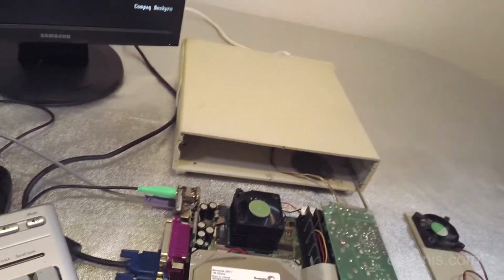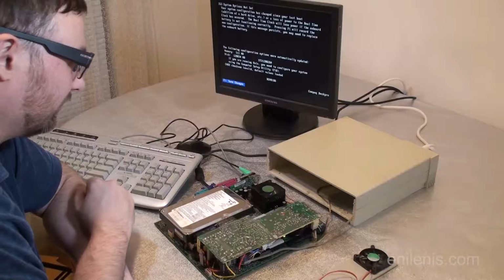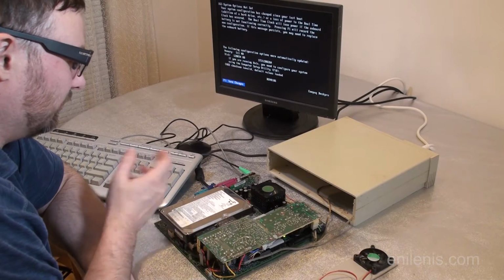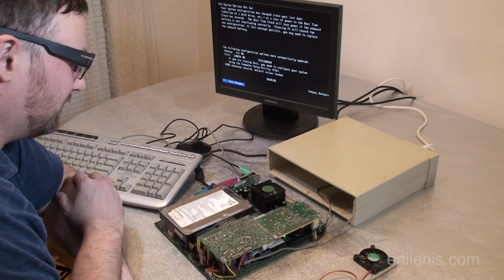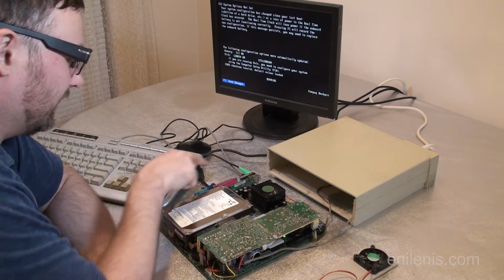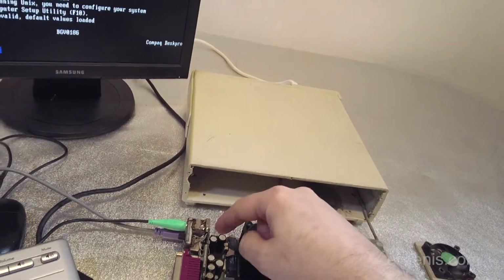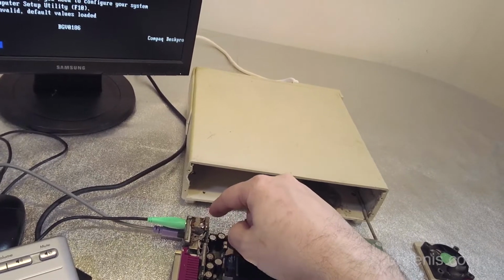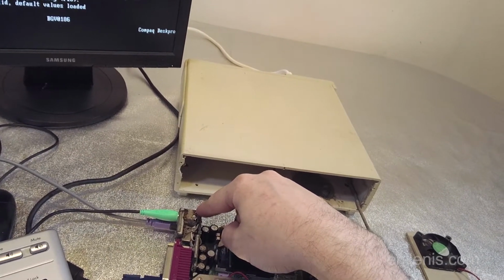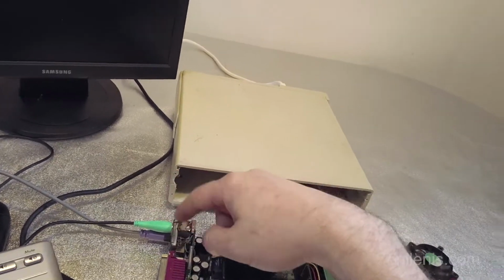And nowadays, it's probably even too old to connect to modern networks. It probably doesn't even support the WPA or WPA2 encryption types. It's probably one of the first generation Wi-Fi USB dongles. Well, anyway, what that switch does is that it either connects data lines to this USB adapter, or it lets the USB port have access to those data lines.